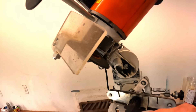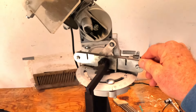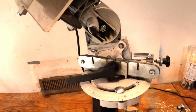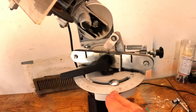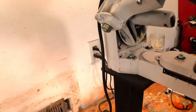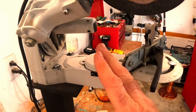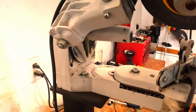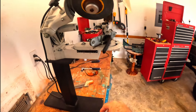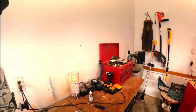It's that good. Essential to any good sharpener, you've got to have a good solid clamp. Notice the lack of wiggle here — there is no wiggle on this thing. You've got to have a good stop, otherwise you'll never get proper indexing. A lot of sharpeners only have a single angle, but this one will also do the typical Stihl chains, which have a double angle. They've got a bevel this direction and a bevel that direction. Most sharpeners will have this, but they won't have that. This thing's solid — I've got it welded into a base, anchored to a table. It's not stupid big, but it's stupid good.